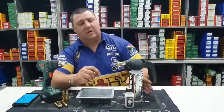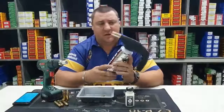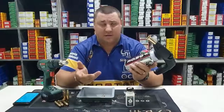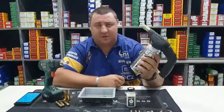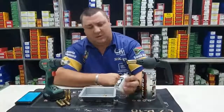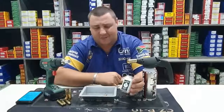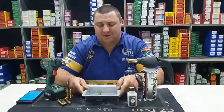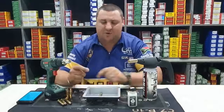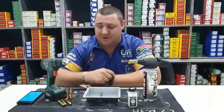Let's quickly go through the stuff you'll need to be able to do this. First of all we need a brazing torch — you can get this at any local hardware shop or at us here at Pretoria Arms. A tin of butane gas to run the brazing torch with. We are using the Tempilac at 246 degrees Celsius. You'll also need some kind of tin, bucket, or tub where you can put your hot brass into, or a tub of water to quench your brass with if you prefer that method.